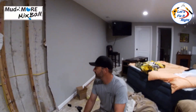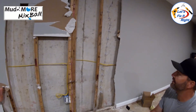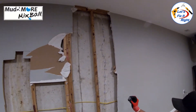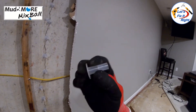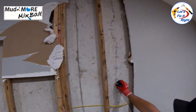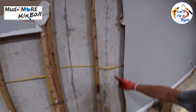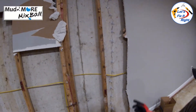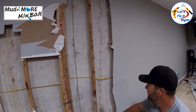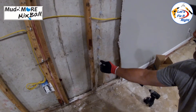What we're doing is we're going to repair this vertical foundation crack. It was letting some water in. We let it dry out — it hasn't rained in about a week, so everything's dried out. The process of fixing the crack involves applying injection ports, which are little plastic tubes with a flange. Epoxy is applied to the rim of that flange and then over the exposed crack. The rest of the crack around the injection ports also gets covered with epoxy. Then we take an injection epoxy — a thinner, runny consistency — and that gets pumped into the crack. We start at the bottom and pump until it fills up and starts coming out of the next injection port.